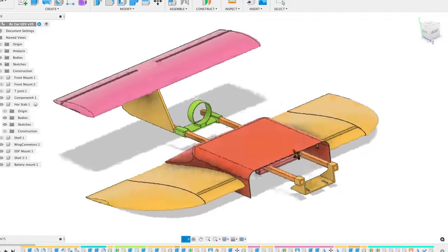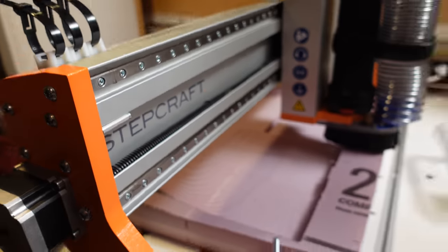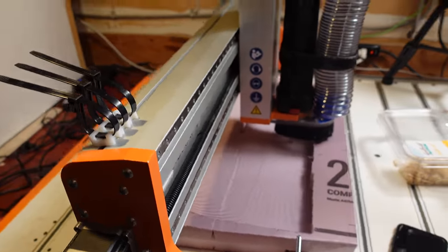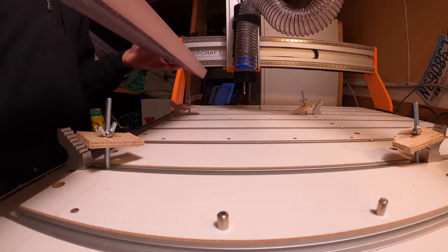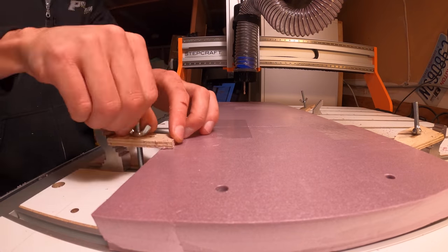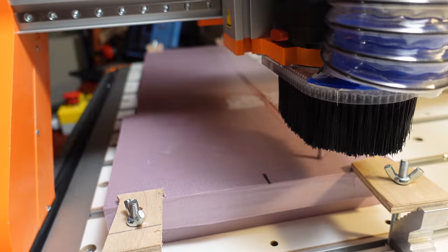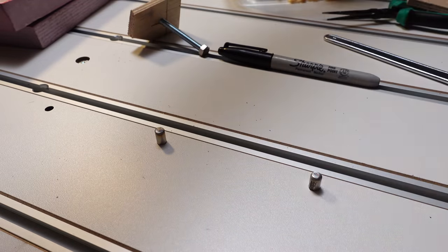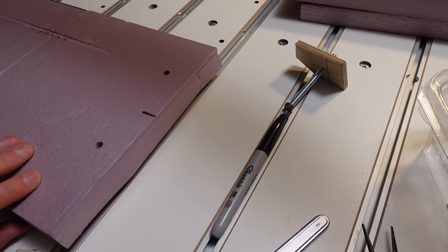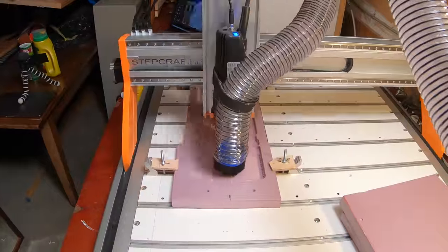Next it was time to start on the wings and tail. This was my very first time machining foam wings on my new Stepcraft M1000. I was super eager to start cutting, which is probably one of the reasons why I kind of rushed the design. To cut proper airfoils, you need to do a two-sided milling operation, which means you need to flip the work piece over to reach both sides. The alignment has to be perfect during this flip, so I drilled four holes into the stock piece that align with pegs installed in the work surface. This ensures the stock is exactly where it needs to be to get the top and bottom halves to line up right.